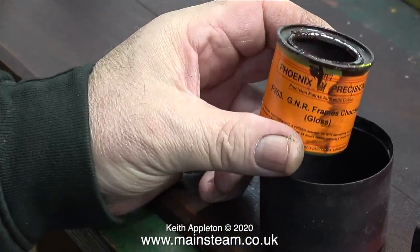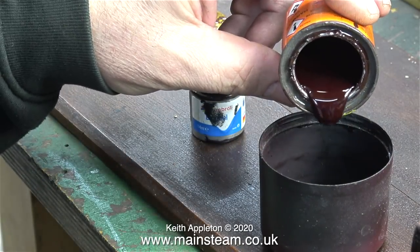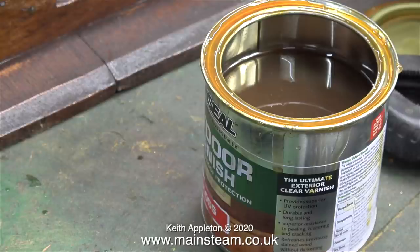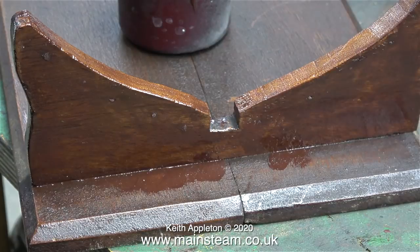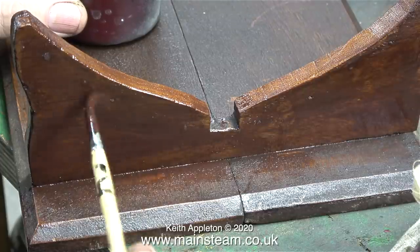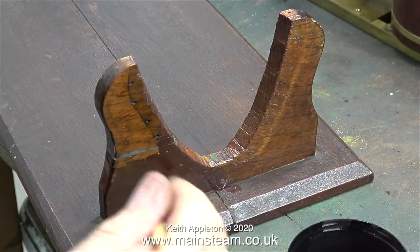Colour-wise I could leave it as it is, but there's still quite a way to go yet. This is a tin of Great Northern Railway Frames Chocolate Brown, and just like the varnish this is also a gloss paint — but I do not want the end product to be glossy. The very last job will be to wipe on some matte varnish to make everything match. What I'm doing is mixing some of this chocolate brown with some polyurethane varnish, and I've added some black paint to dirty it up — but I've put too much black paint in there, so it's back to the drawing board. After a bit of experimenting, this is the colour I came up with. It doesn't match the base, but I'm not going to paint the base with it — this is just for the uprights, which were originally made out of a different piece of mahogany to the base.